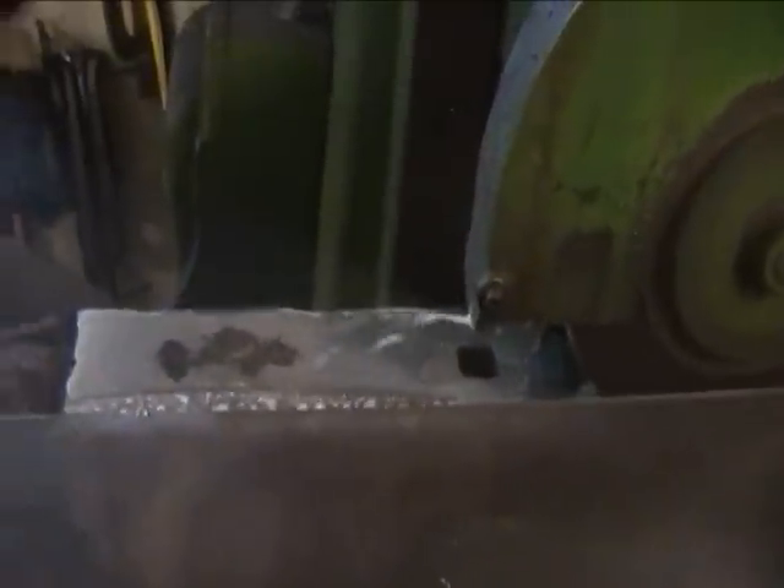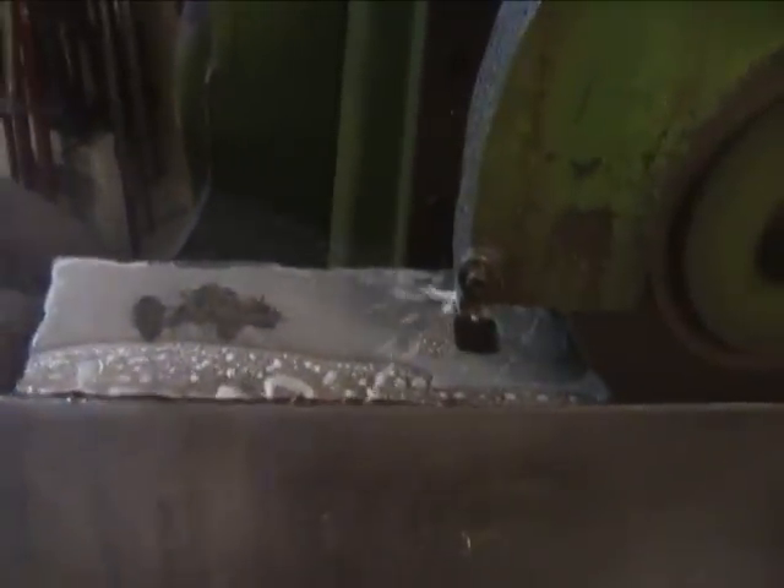It's pretty clear that I'm grinding an anvil here. The reason I stopped the machine just now is to show how this particular anvil is cleaning up. If you can see right below my finger, there was kind of a dip in the middle of the anvil and it's almost cleaned up. I've probably taken about 40 thousandths or so off. I'm just going to continue until it's all cleaned up, but I just wanted you to see this shot of where the anvil is at this point.